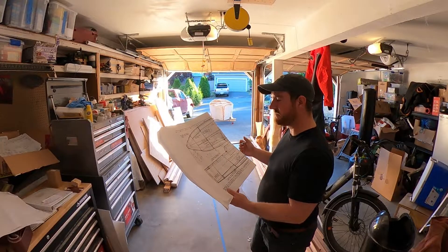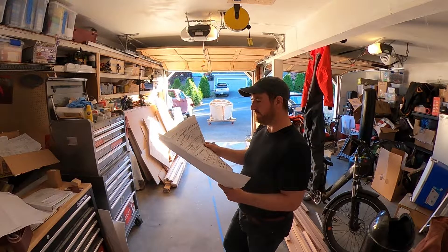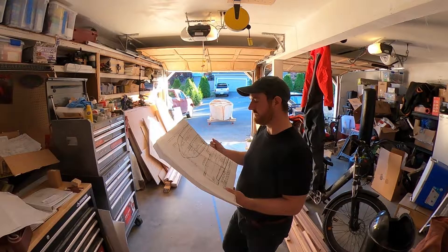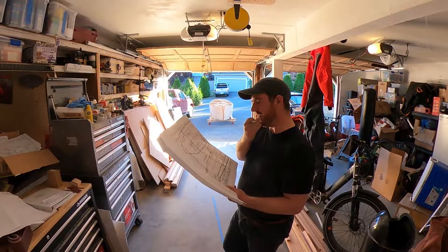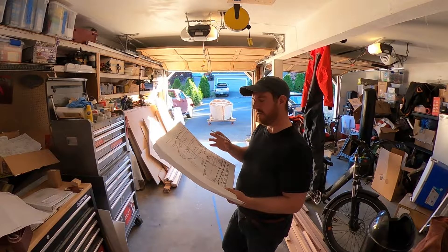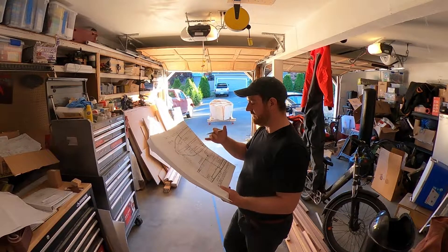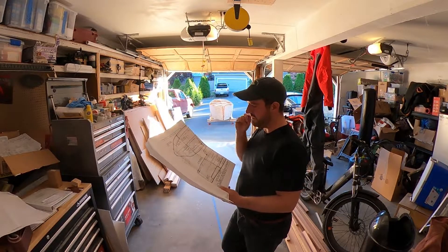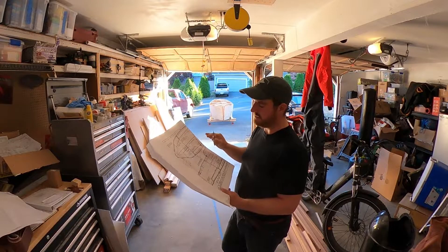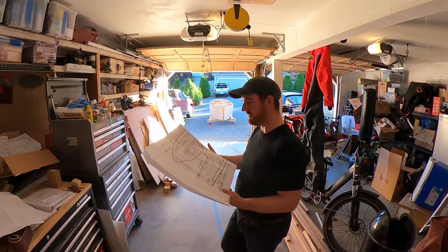These are all really fairly close to 90 degrees — they're not too varied. The biggest excursion I got was about 18 degrees measured off of 90, so 108 degrees for joining. But all the angles I got were a little big for what I actually wanted to join. If I'd used slightly shallower angles, closer to 90 degrees, I would have needed a little less fiddling and a little less epoxy fill on some of these. It is complicated because the angle at the top of the boat may not necessarily be the angle at the bottom of the boat, just because of the curves and the shape of some of these panels and the curvature of that and the stem.